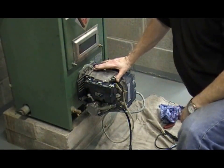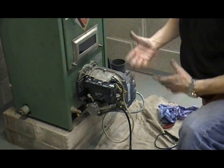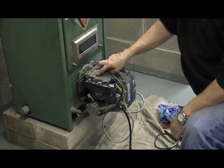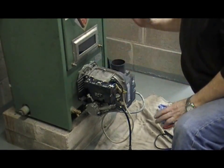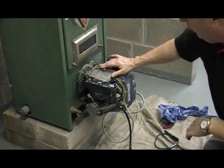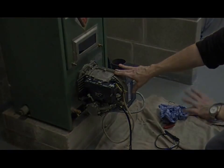That's one of the problems you see with a small burner. The solenoid is replaced — most engineers would have carried spares in the van. The air intake on this side can be fitted with a snorkel for bringing outside air in. You have the oil pump obviously delivering the oil and an ignition system in there that's igniting the flame. Servicing means stripping down the whole burner and the whole boiler, cleaning everything out, and replacing the nozzle — these need to be changed every year. The most important finishing step is the use of an analyser.